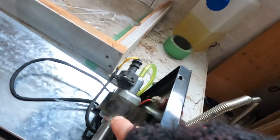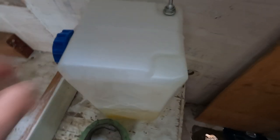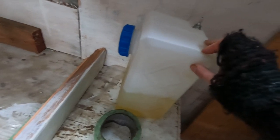Here is the fuel filter and the pump, which I eventually want to replace with a silent one. And none of these connections have any kind of crimping on it. And this one here connects to the top of my diesel tank, which eventually I think I might get a big one, but it connects to here. And it had slipped up here. And I think what had happened is, because it's been so cold in here, everything shrunk and got loose. And as things get loose, fuel liquids can escape. So I think that's what happened. It made a bit of a mess.